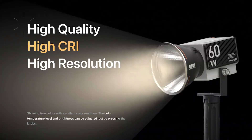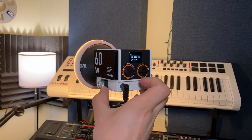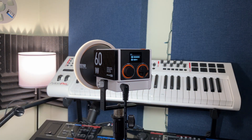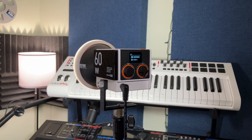This little flick wheel is the CCT, or color temperature wheel. The maximum color temperature is 6,500K. We can bring it all the way down to a low 2,700K, which is a very tungsten color. Pressing the center brings it back to a neutral 5,500K. Being able to dial in the brightness and the white balance is something I love about this light.